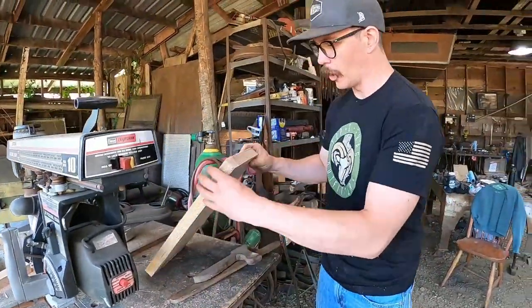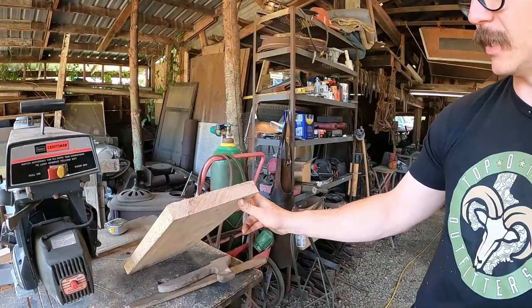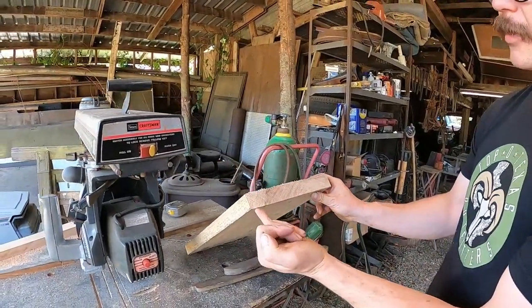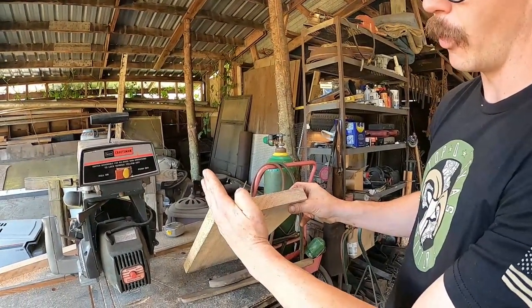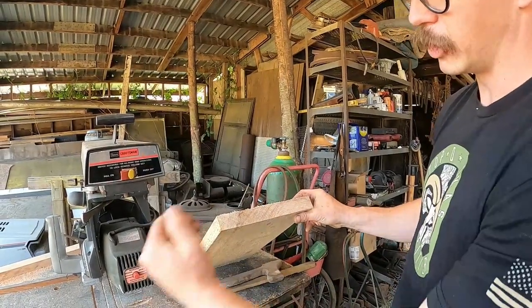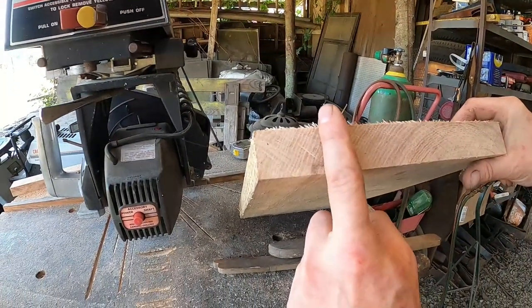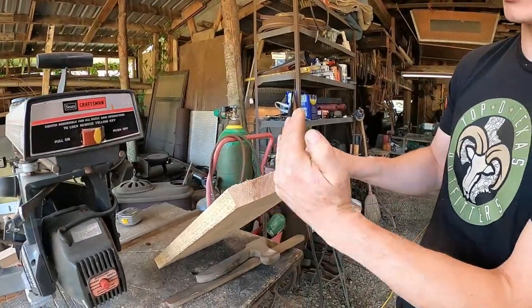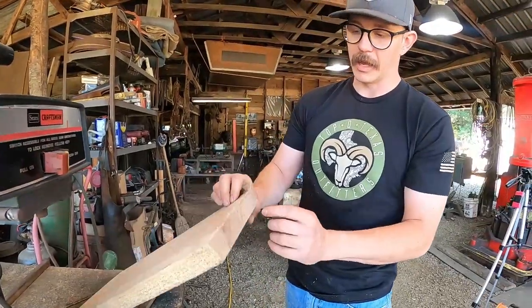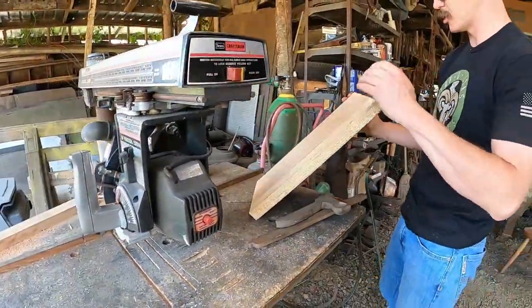Yeah, but also each board, you're cutting it from a tree, so you just got a slab of these round pieces. Often the piece or two on the edge isn't great. On that one, the grain's going almost horizontal, and it should be going vertical. So that first handle is just going to be a sacrificial piece to get it out of the way, because of the grain. Then we start getting into diagonal grains, but those are B grade handles. And you can tell we got one or two in the middle that are A grade handles. They're tight, straight grain. We want the A grade on mine.